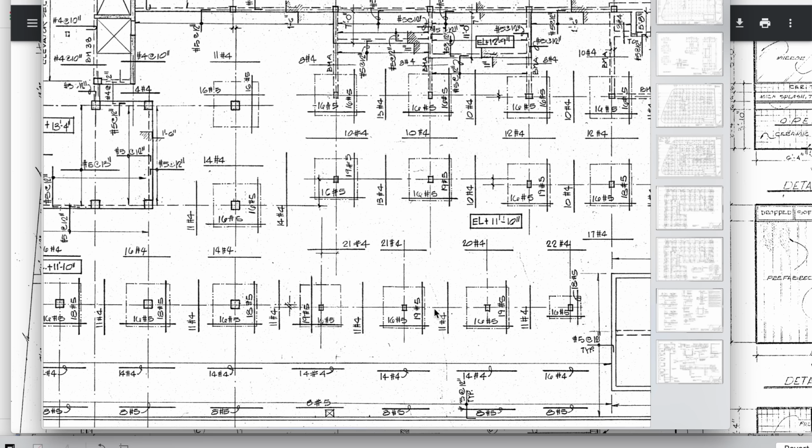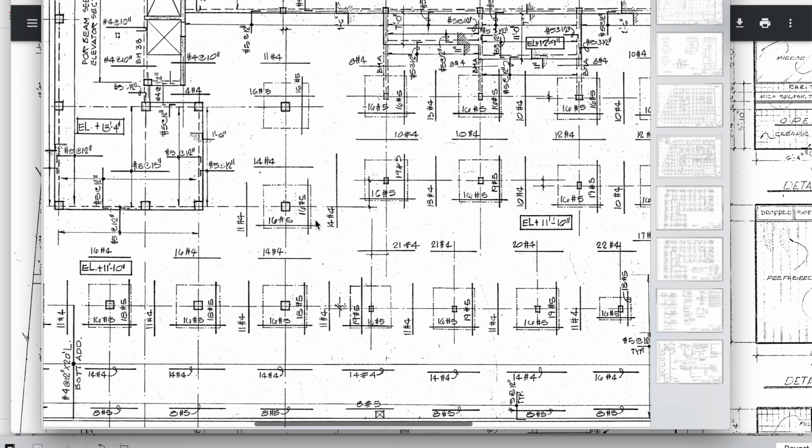But to grab it going from this side to here, they use a half-inch rebar because it says 24s, and that would be from center line to center line. So these are using number 4 rebars basically all the way out here. And there's 10 in this direction, there's 21 in this direction, and it reduces down to 20 over here, 21 over here. It's a lot of half-inch rebar. Inside the parking garage area, that's where the failure happens. We really get dumped on.